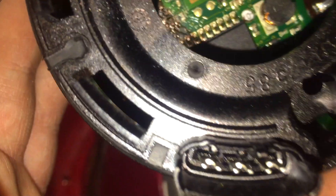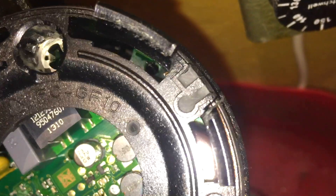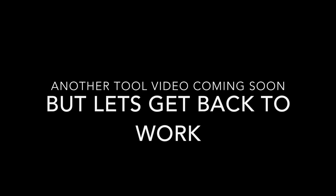They're only three-wire, which means all the magic happens in this bit in my hand. That also probably means Grundfos could do an adapter where we could plug something in that would give us a hole in the center so we could still bleed the pump the old-fashioned way — instead of fitting them and then not being able to bleed them. Anyway, thanks for watching.